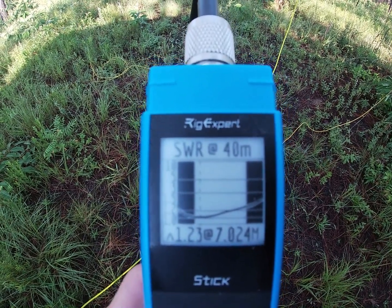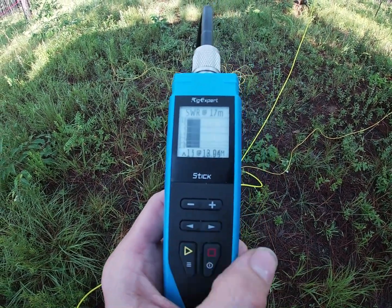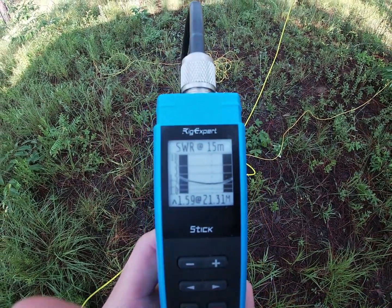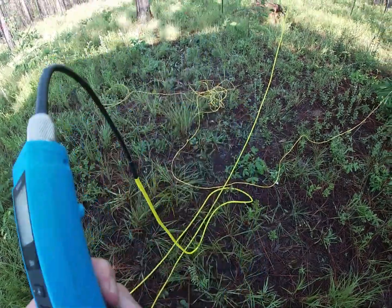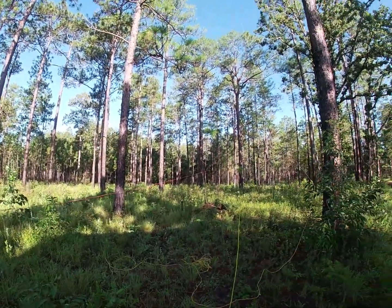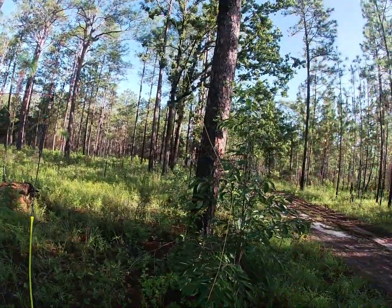I'm right where the general portion starts on the 40 meter band. Let's go to 15 — and it drops down basically into the voice portion of the 15 meter band. It is kind of a compromise; it's not a dead match for either voice or CW exactly where you want to be, but it will definitely work.